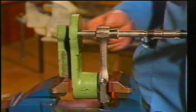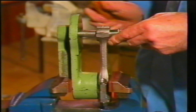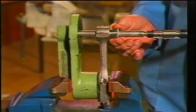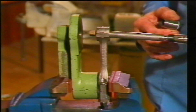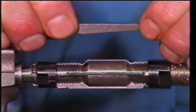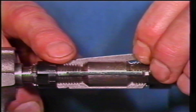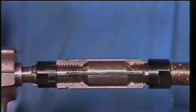The connecting rod is aligned with the VW 214F for reaming. The adjustable reamers were originally supplied for reaming the bushes on link pin axles and small end bushes. The cutting blades sit on a tapered seat. When the locking nut on one end is unwound and the adjusting nut wound forward, the blades are moved along their tapered seat and so expand in diameter. The adjusting nut has lines around it.